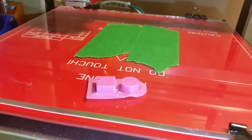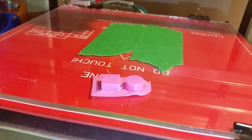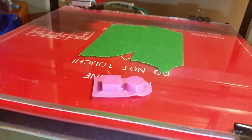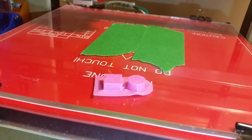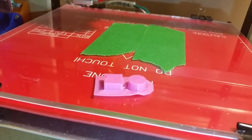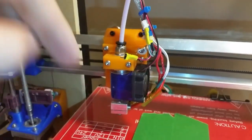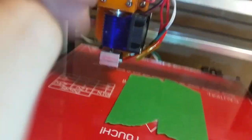I decided I was going to follow the advice of a bunch of other people, which was to fully season the head. It took a fair amount of cheap canola oil to just try it. I kept dipping the tip of different PLA in as I was putting it in. And then when I got it working, I reconnected the Bowden tube with some fresh oil on that too, down inside. And I noticed there was absolutely no stick.